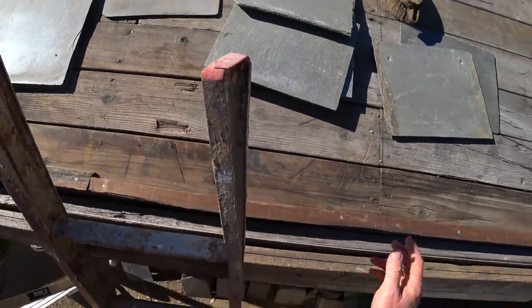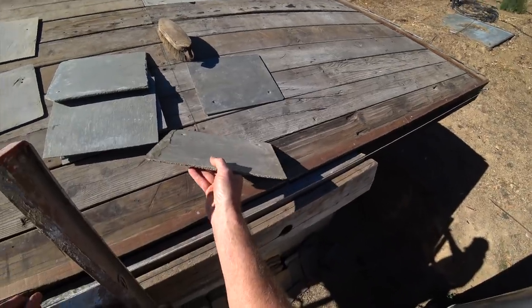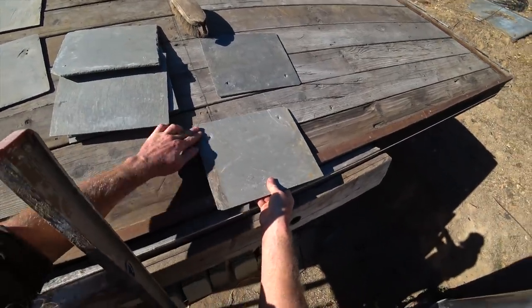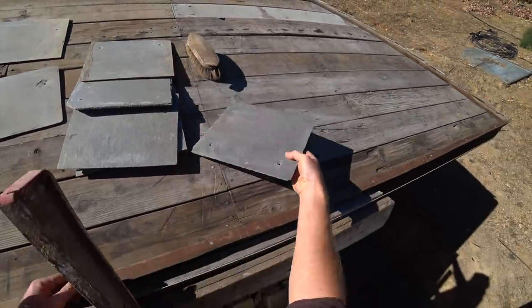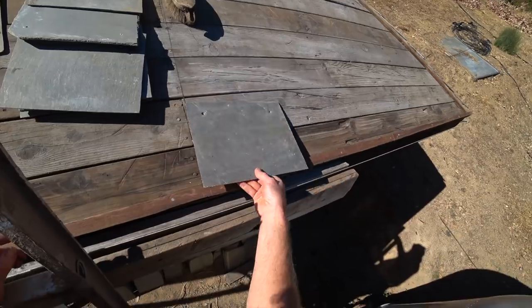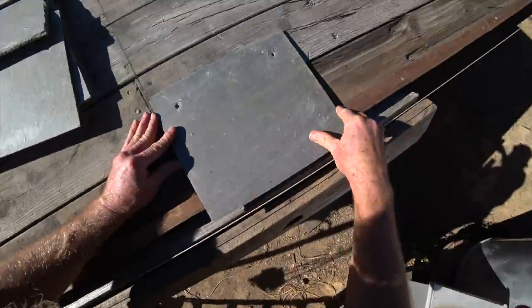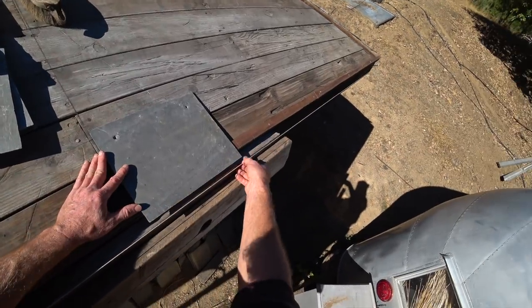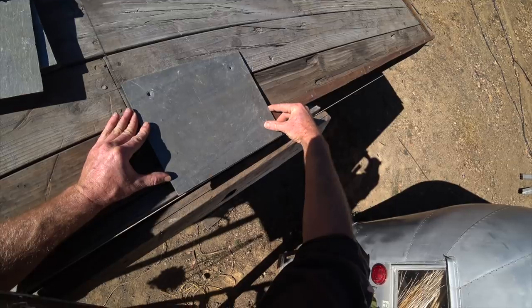That's gonna help when I'm installing the first row of slates too. We're gonna look at these pretty carefully as we go - this might cause a problem, especially on this first row. I want everything to be pretty uniform, so the first two slates are lining up at the center right here. I have a string here which I can sight down to make sure I get the overhang.